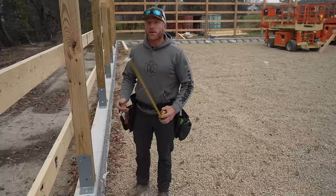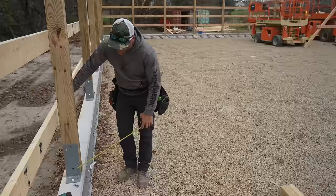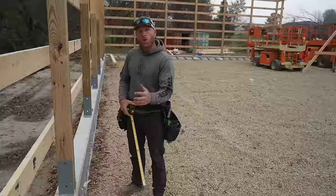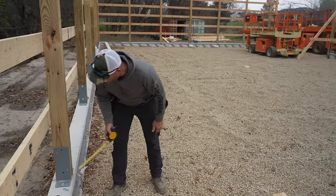All right, so for the girder truss to be installed, it's a 3-ply girder, and it's gonna go right next to this 3-ply column. So we're actually gonna add 3 additional plies to support the weight of that down to the foundation. Now we have a bracket already installed, and we've decided we're not going to uninstall this. We're gonna router out 1/4 inch of the first ply. We're basically going to laminate the 3 plies to this 3-ply, and then we're going to add another bracket to the outside, in essence having three ears, and then we're gonna get long bolts to go through this whole thing. So the nice thing is, this is a 3/16 bracket.